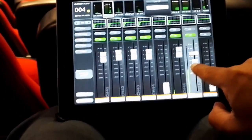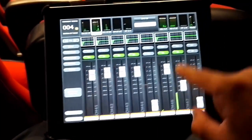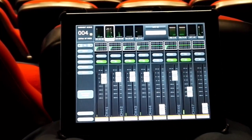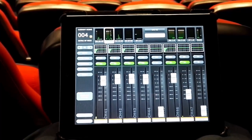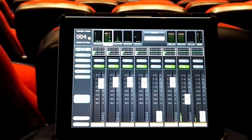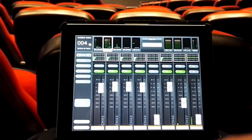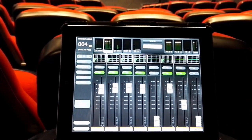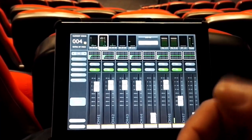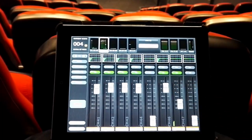So guys, basically the input sensitivity or input gain from the transmitter is quite high. It's plus 20 dB. It shouldn't be plus 20 dB. I've set them all to 0 dB. But the only way it works with AKG is I have to get it synced from the receiver. I can't just change it from the transmitter like Sennheiser or Shure.